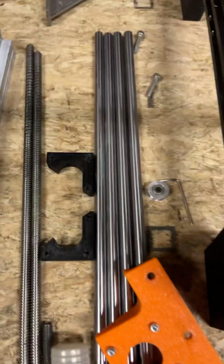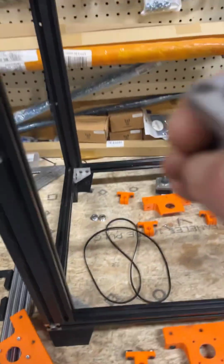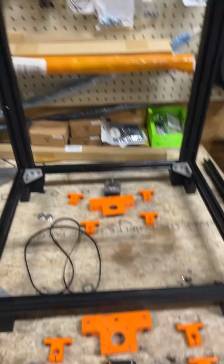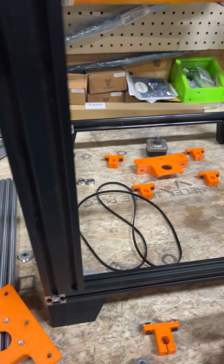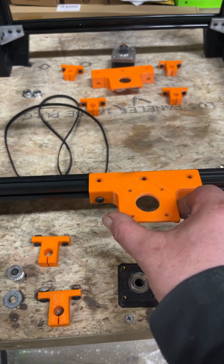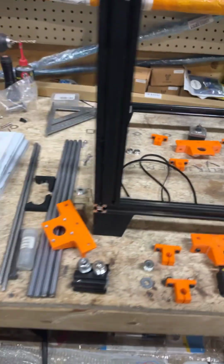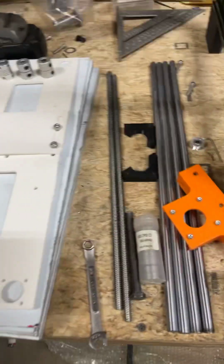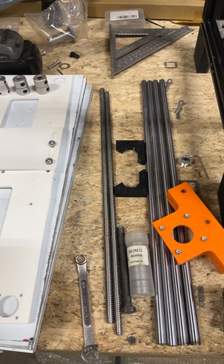millimeter. The rods, basically you're going to have 4 Z rods that are going to mount on these brackets to the left and the right of the stepper motors on both front and back. The outside one at the front is going to be outside the frame, kind of like that, and then the one back there will be inside the frame. But how you mount them depends on if you want 350 or 400. But like I said, if you have to buy your leads, they're probably going to come 400 anyway.